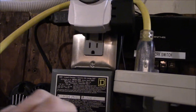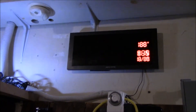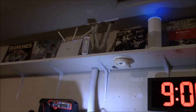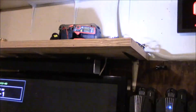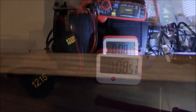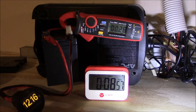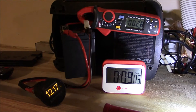All right, let's plug it back in. Everything's coming back up. Now what I want to see is how this APC battery backup charges batteries. So I got back up on the ladder — let's take a look at the current meter. As you can see, about 290, 280 milliamps going into the battery. I'm going to wrap this up and probably do a part two follow-up with a different battery to see how long it lasts.